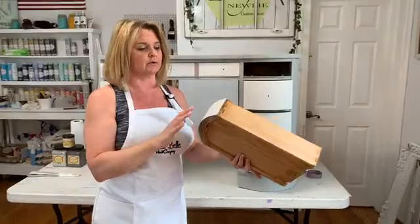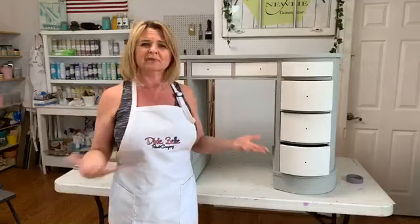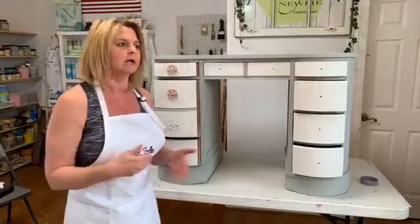I had a little bit of concern painting it that it was going to do some bleeding, and I did not put Boss on it. I was going to. I actually started with Slick Stick on it, and normally I don't use Slick Stick. Normally you don't need it, and generally you don't need both Boss and Slick Stick, although on rare occasions you do. But I just felt like the wood was a little too slick to put paint right on it. It probably would be okay, but I felt a little better putting some Slick Stick on as a bonding agent.